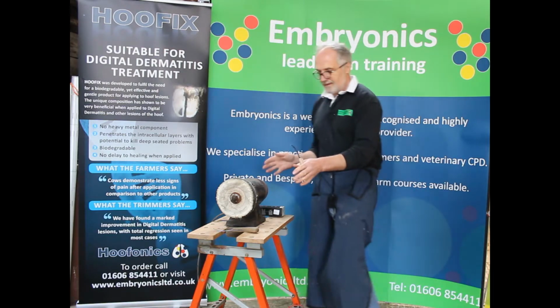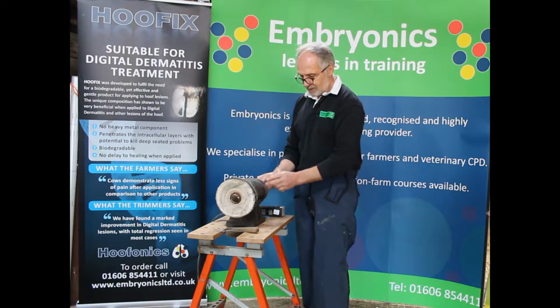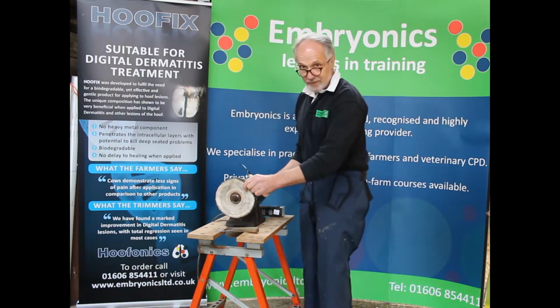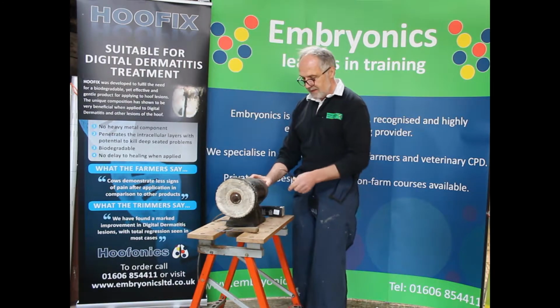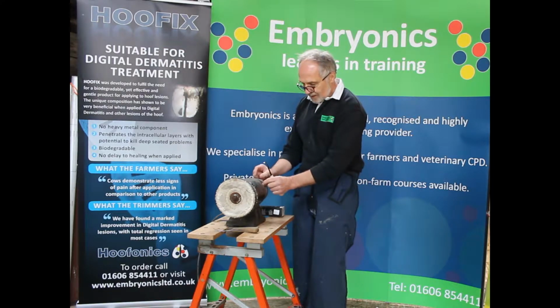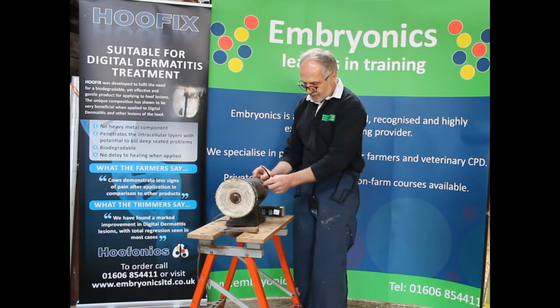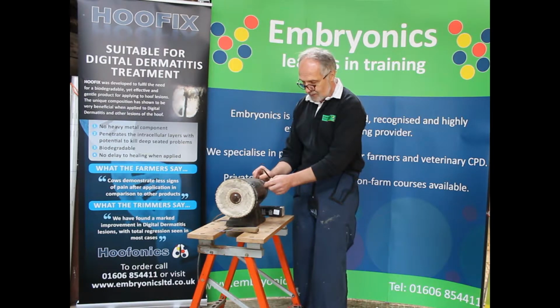The next crucial part for the grinder is the type of disc we have on them. We've got a rubber wheel and we've got a buffing wheel. The rubber wheel is a special rubber composite. It's got really small iron filings embedded in the rubber, and it's a certain size of filing embedded in rubber, and that's what sharpens the knife.